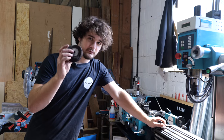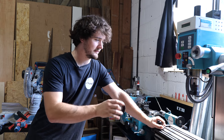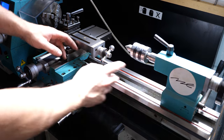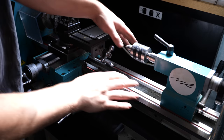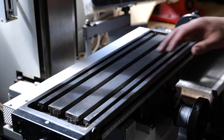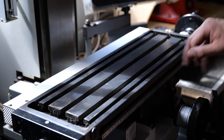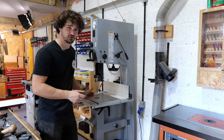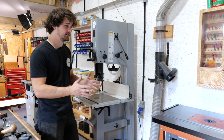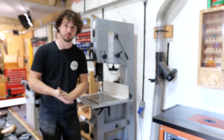Moving on to the metal machines, I won't do too much of this abrasion on the table because I don't want to accidentally round off any edges that shouldn't be rounded — these carriages and tailstocks rely on so many of these faces and facets to keep them locked in. Same again with the milling machine — there are little patches I can sort out, but no heavy scrubbing. You can get away with this on woodworking machines because they have such wide bearing surfaces and the wood doesn't need to be perfectly micron flat like you would with metal.